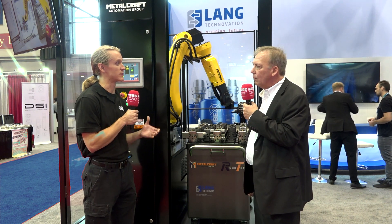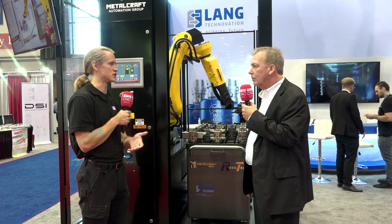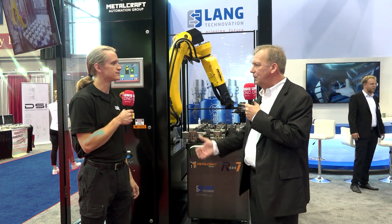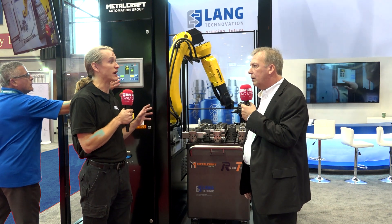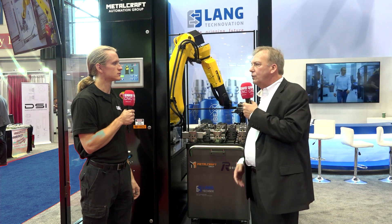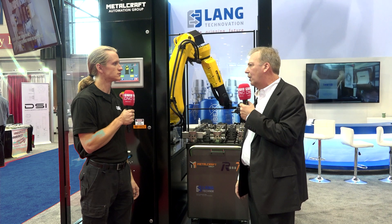With the two carts, you're really getting that high spindle utilization. The cell does not stop just to take out your finished parts and reload with new billets. Exactly — the goal is to get the maximum use out of the machine and maximum use out of the robot. We've even seen this where it's been put between two machines. With a cell like this, does it still have that Lang micron repeatability? Yes, it sure does. Everything is based on the zero-point system, so with the vices and everything, we're keeping that repeatability and accuracy that our customers want.